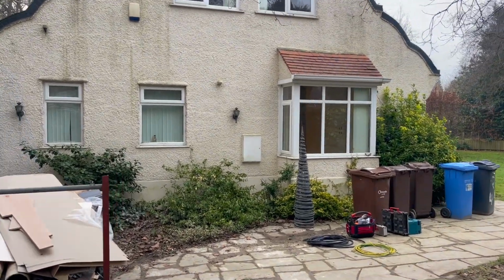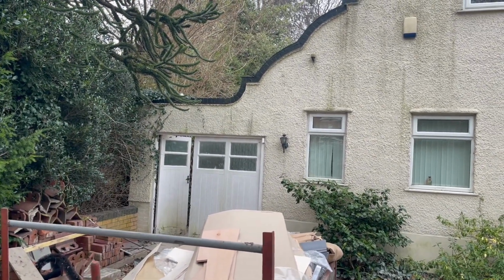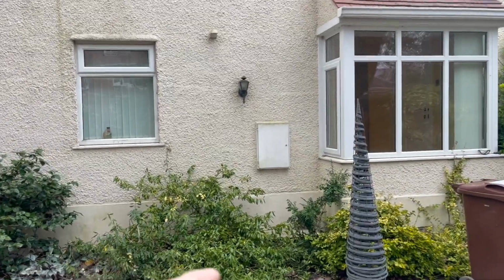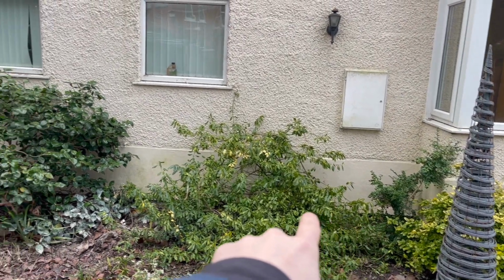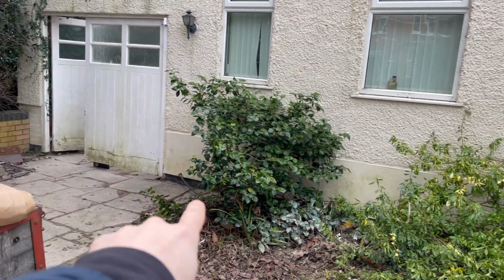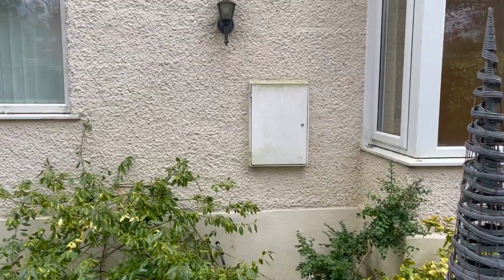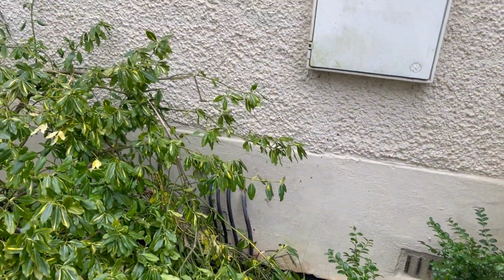This job, Powerwall's going down the left hand side of the house, just where that garage door opening is. The AC run, as you can see, I'm going to hide it. If you look at the bottom, there's a little black bit, a lip, so we'll probably hide it just underneath there. All the way along the bottom, around, and then to the Powerwall. We're going to enter the building where all these armours have entered, because that goes below the floor and then back up again.